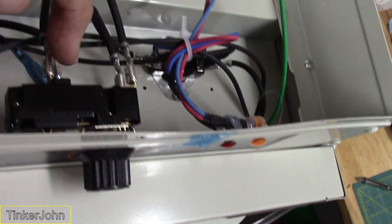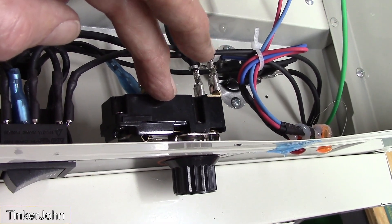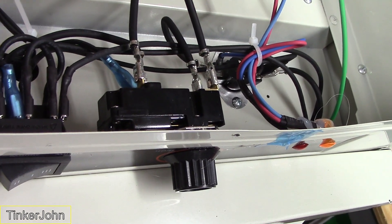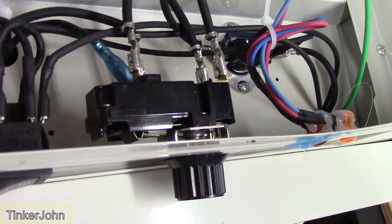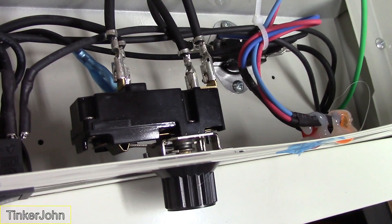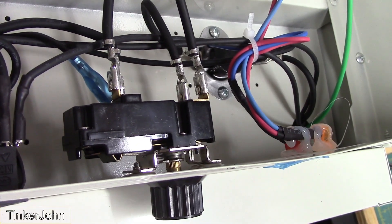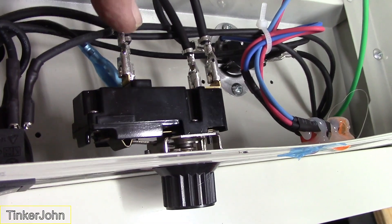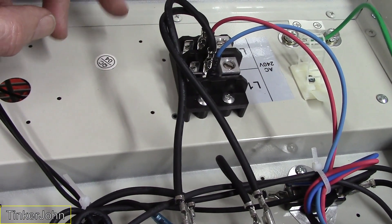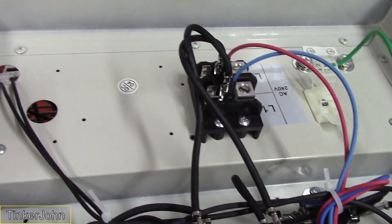There is one thing that's a little concerning — just a characteristic of this heater. The thermostat and master power switch are located right here on the unit itself. I would rather have a wall thermostat, but when you'd rather have stuff, sometimes it costs money, and being retired limits that. If it doesn't work out, I'll spend a dollar or two and get a 240-volt wall thermostat — this requires a 240-volt thermostat if you want a wall-mounted one. Or you could add a 24-volt transformer with a regular heater thermostat. There's plenty of room inside here if you ever wanted to do that.